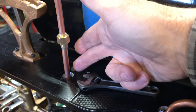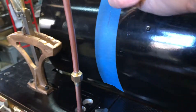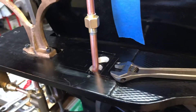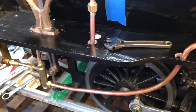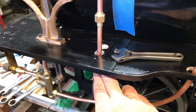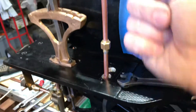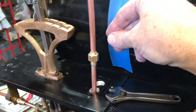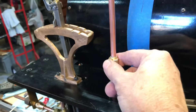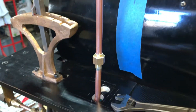I drilled two holes in the running board. The piping for the whistle will fit from here, go straight down — I'll probably make it pretty much the same way, in two pieces: a piece that comes down here like a bent L that goes up through this hole here, and then another one that comes straight down. I'll probably put a union somewhere similar to the way this one is placed, but offset a little bit for wrenching purposes.